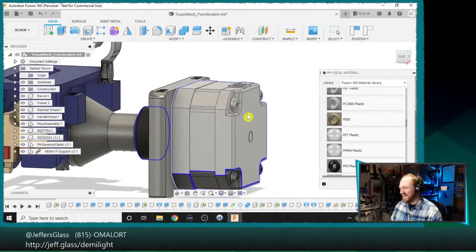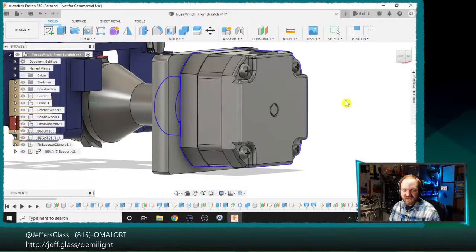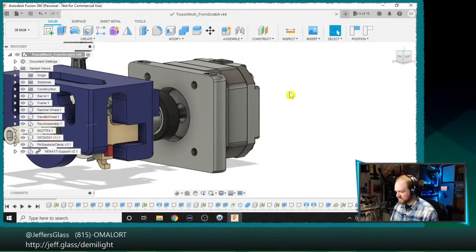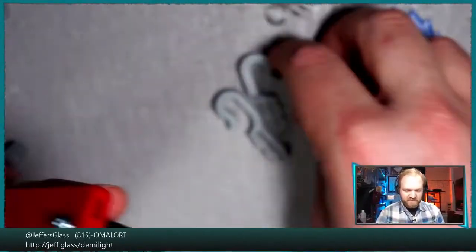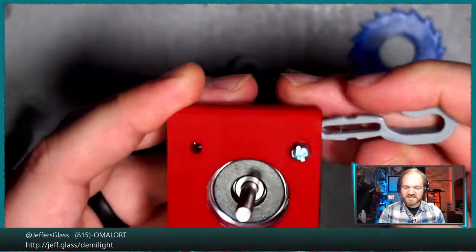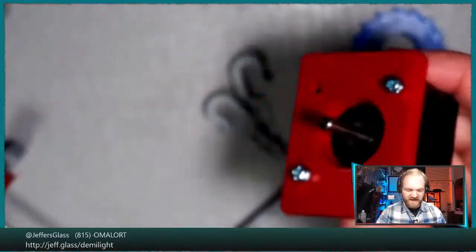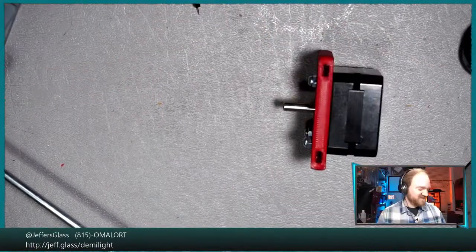Okay, so working from, hey Cookie, yeah, we'll see about fire this time. We are going to try and rev up this stepper motor by the end of the night. So, NEMA 17 stepper motor in the back, which has this mounting plate that we designed last time. Some weird selection things going on with my copy of Fusion here. But that mounting plate is complete, and it will have the same press fit pin hooks that we've been using for all of the rest of our components, although they're, as we noted last time, a little bit snug because we didn't oversize this pin before using its profile to cut out of those top holes there. But that will mount to our 44mm truss, which is our standard mount. Here, maybe we can lay the parts out on the desk as we go through them in Fusion, and we'll see if we've remembered to print everything.